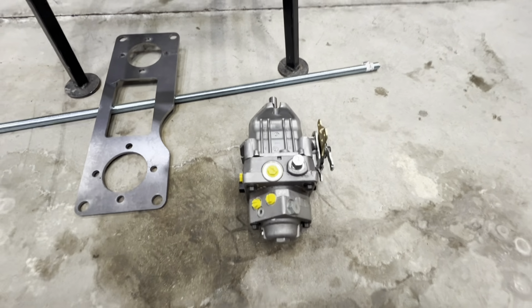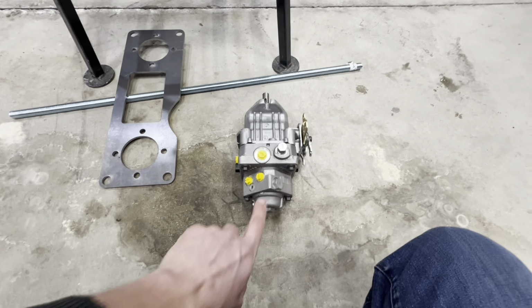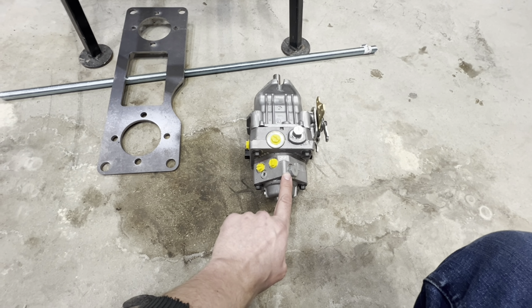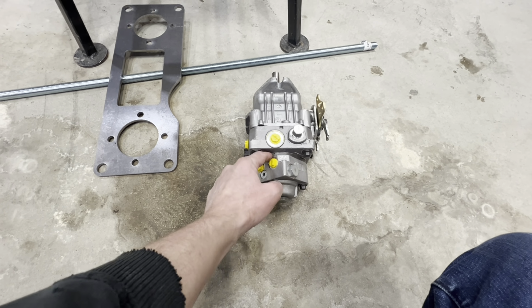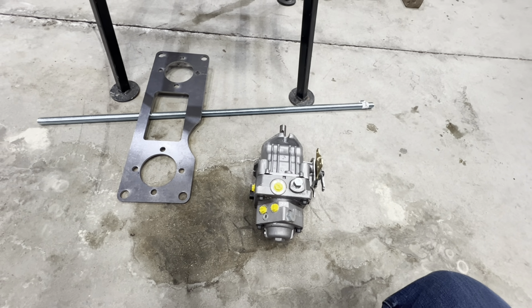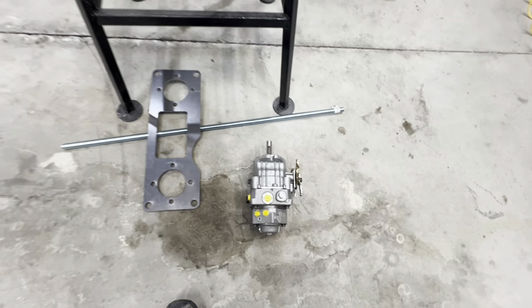And we really don't need that on the PTV. We're going to take these auxiliary pumps off and swap them onto the mini Snowcat because it has the normal charge pump cap, and that's what we want on the PTV. So a little bit of swapperoo between this and the mini Snowcat.